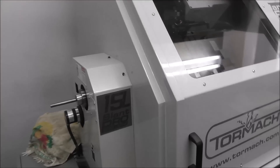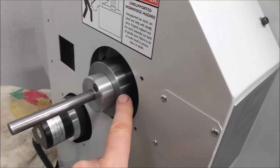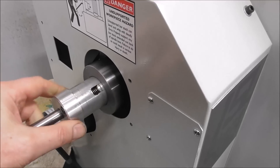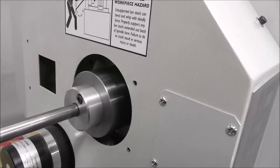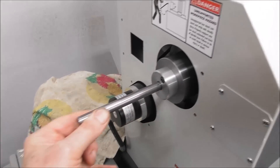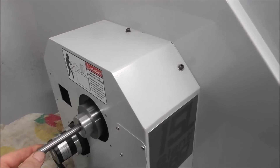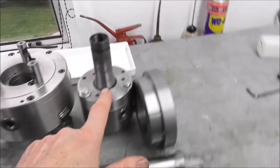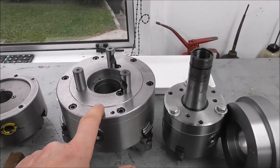I'm getting geared up for a bigger production run of parts for the Hallmark impact tolerant touch probe and I've been doing modifications to help me with that. I've made a spindle extension — it's a bit like the stock extension for the collet closer but I wanted a slightly different setup. I've used my existing spindle stop to go in that bore and it's bolted on the end in the conventional place. I've got a long spindle stop adjustment for certain types of work where I need to reference the part within the spindle. I've also made up a manual 5C collet closer and a drawbar for 5C chucking, but the D14 system is a lot more rigid pulling up on this face.